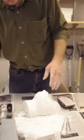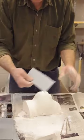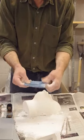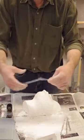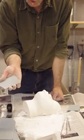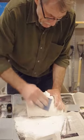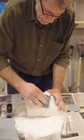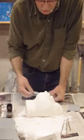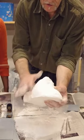Because this is a curved surface, we're not going to use the sanding block. What we'll do is grab one of these pieces of sandpaper and break it up into two pieces just by folding it like that. Now we have a nice little piece that fits in our hand very well, and we'll just use our fingers. After a few swipes of the sandpaper, now that surface is significantly smoother.